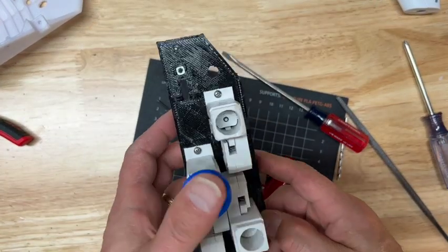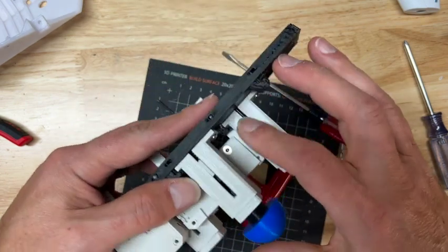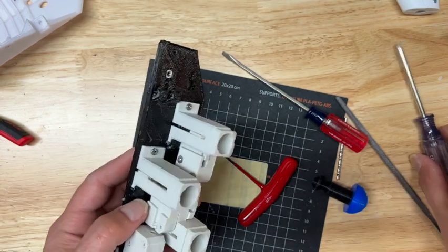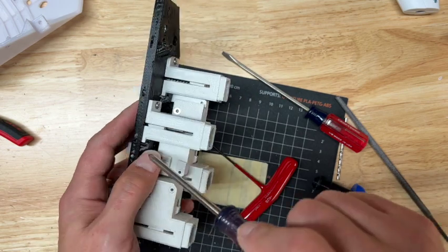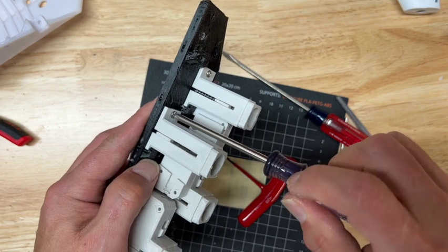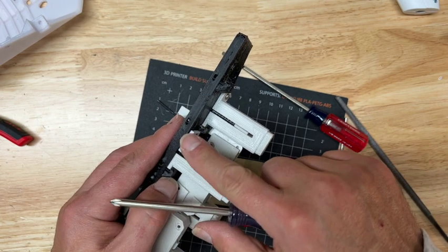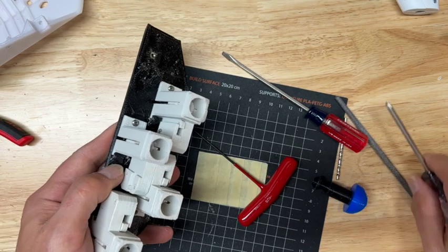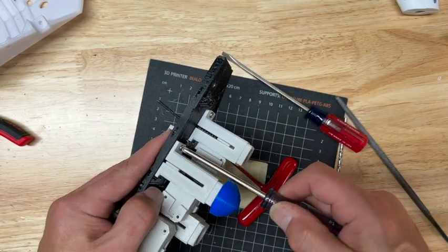Okay, so I'm on the 4th rocket right now. Just want to show you a little possible problem here. So I've got it installed, but it pinches at the bottom and doesn't launch. The mistake I made was I put a torque on here trying to seat it into these catches, and that's causing it to bind at the bottom. So what I did is just loosen that screw that took the tension off of that joint. Then I'll tighten it back down and then just do a test. Still not quite where I want it to be.